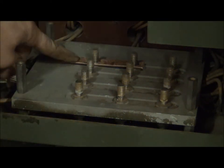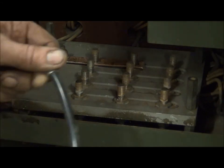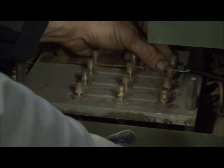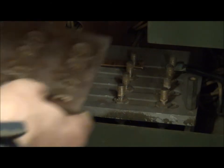We have one of the jumper bars installed now. As you can see, we've removed the thickness of that original bar from the back terminal, which is the perfect place to install our jumper wire. We'll install that right there and leave it dangling off the side for now, then go ahead and reinstall the voltage reconnection plate.